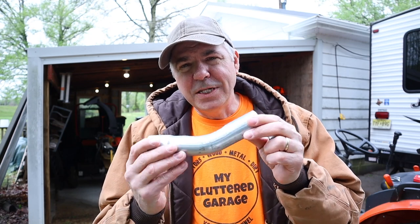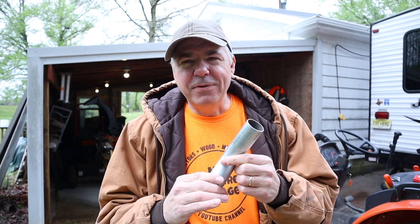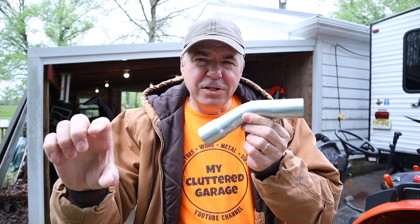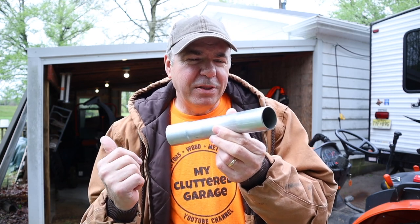So here's what I'm going to do. I picked up this exhaust elbow — it's actually made for a generator, and I'll put a link in the description if you're interested. It will work but needs a little bit of modification, so you have to be a little handy. If you're only relatively handy, there is another solution you can do without modifying it at all, and I'll show you that — but I'm going to take it one step further and modify it just a bit. The idea is to attach this to the current exhaust on the tractor and divert that exhaust a little further away from the front.